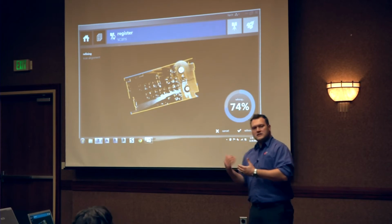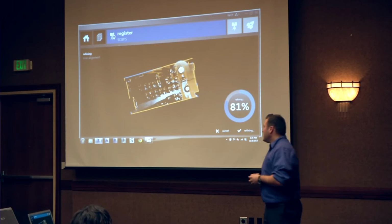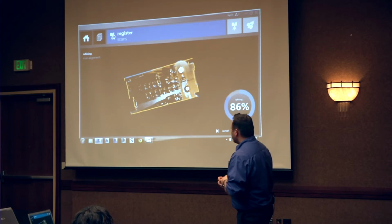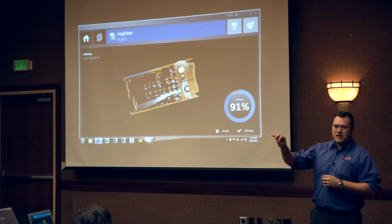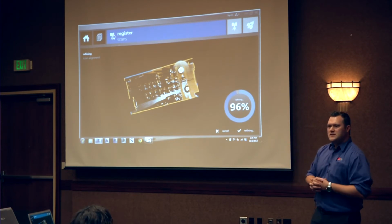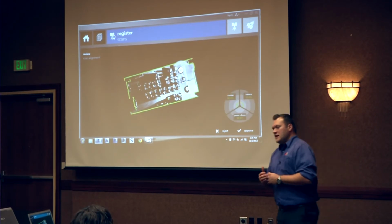but without needing to spend a ton of extra time on using or setting up targets and making sure our geometry is good and everything like that. So instead, we're using what's called cloud-to-cloud registration for the process. With this same software, you can identify checkerboard targets and still use those and assign it to a coordinate system if you need to.